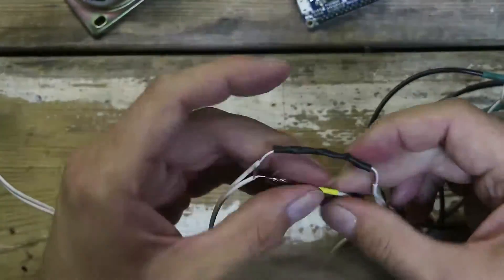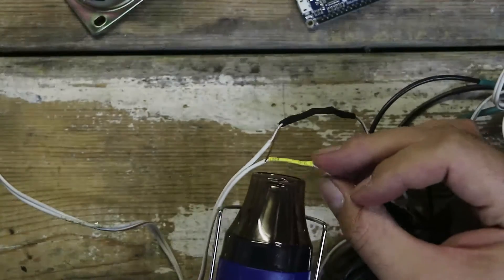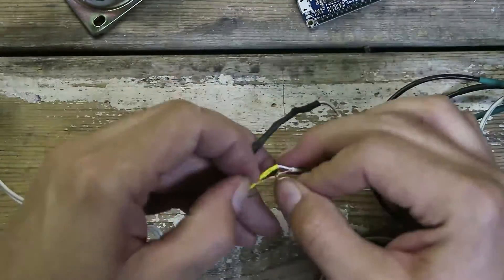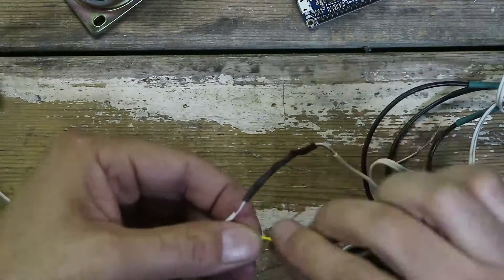Because it's stereo, the four audio wires are paired inside of an insulator. So here I'm soldering the first pair together, enclosing it in heat shrink, and then I'll solder the outer pair around that and enclose both in a second layer of heat shrink.